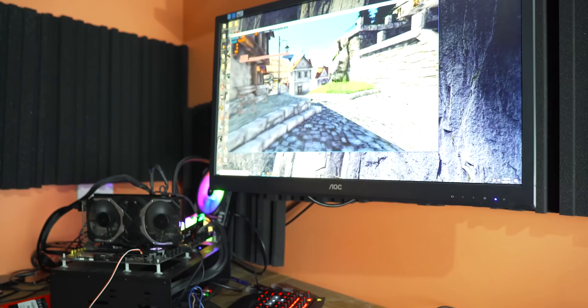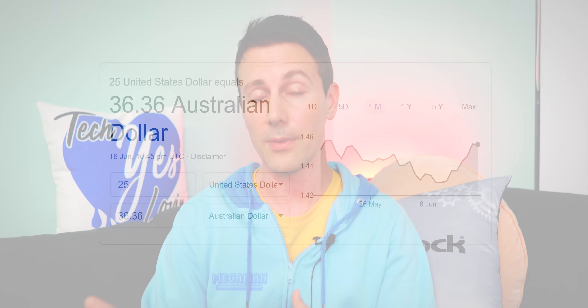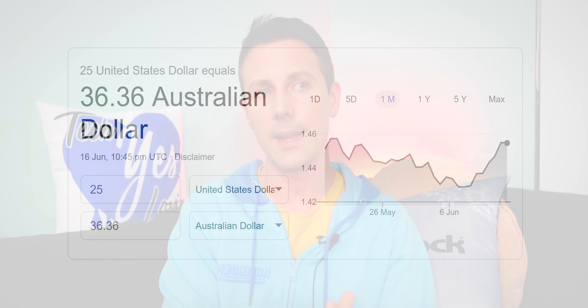A lot of the times, as we saw in even the recent video, we had two cards that came back to life, but then pretty much died quickly in that they wouldn't work after just a couple of minutes of stress testing. That's probably the most likely scenario, but it still doesn't take away from the fact that I've got nothing to lose when I cook these cards up, because I can't micro-solder it for anything. And if the card's worth enough money, I'm gonna keep it aside and take it over to Taiwan or try and get it fixed at a service center. For something like the GTX 650, I wouldn't pay $25 USD to fix it at the service center because it's just simply not worth it. Hopefully that clears the air surrounding the heat gun method — when you've got nothing to lose, you've got nothing to lose.